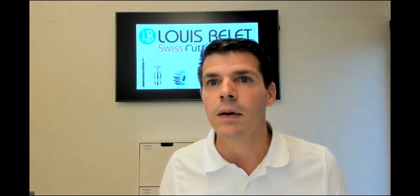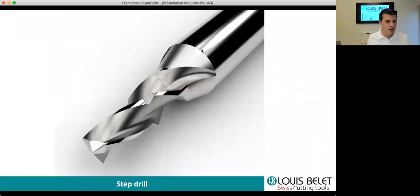I will come back now to the presentation, showing you here a special tool, a custom tool, because it's very important for you to know that this drill can be customized, and it can be specifically designed for your own needs. Should you need another shank diameter, a dedicated drilling diameter with tight tolerances? Should it be a step drill? We can also do through coolant, starting at 3 millimeters, so really fine through coolant holes inside the drill. We can really adapt the design to your most demanding needs.